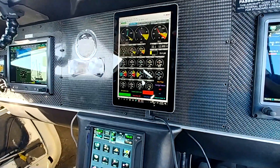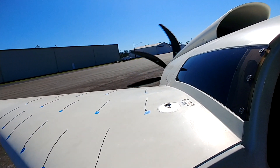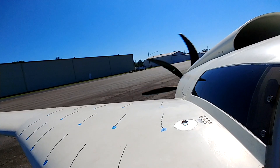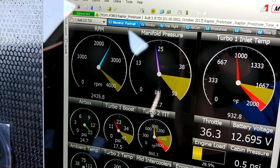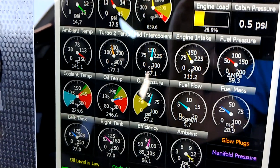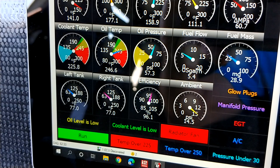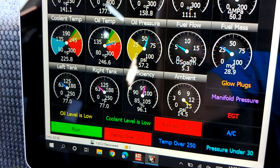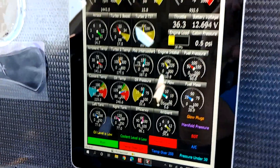The purpose of this test was to find out what power setting, while sitting on the ramp, allows all the temperatures to reach equilibrium — in other words, a power level I can just maintain without overheating. Towards the end of the run, after about an hour, I've got it running at 2400 RPM. The most important temperatures are the coolant temp and the oil temp: 225 and 246, which is acceptable.